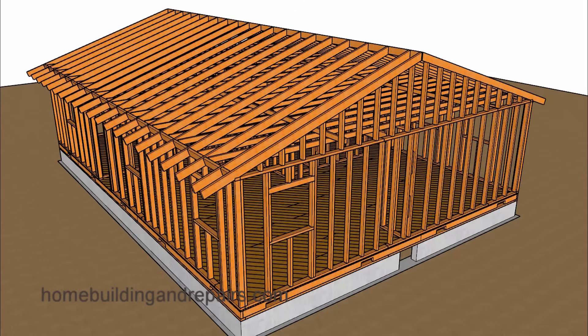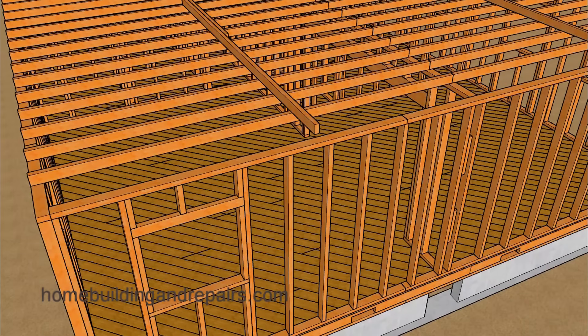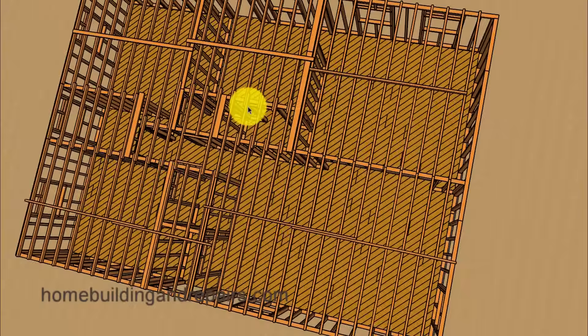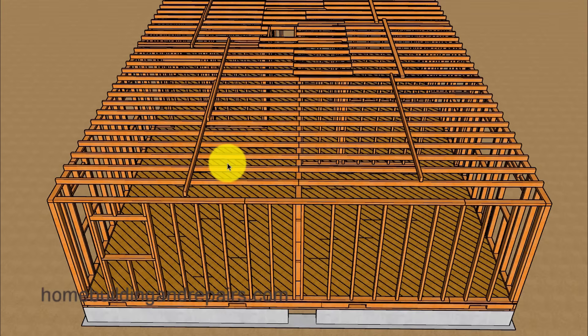This is the next video in our series for the old house remodeling project, where I'm trying to provide you with a variety of different ways to remodel an older home and some of the problems you could run into — like this one here where we have a sagging ceiling. I've seen plenty of homes with two-by-four joists, even full dimensional lumber, where sagging isn't uncommon. Most of the time it's going to have something to do with over-spanned joists that are too small, or additional weight placed on top of the ceiling joists — for example, when you store too much stuff in the attic.